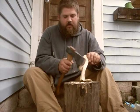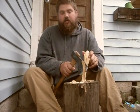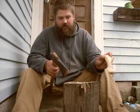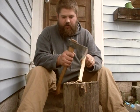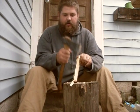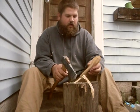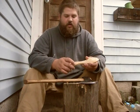Take the hips off on the back side just like you did on the front side. A safety tip: don't bring your axe way up here - you'll hit your hand if you're off or your hand is tired. After doing a bunch of spoons, your hand will end up getting tired. So don't bring your axe way up above what you're cutting - try and keep down low and off to the side of where your fingers are. My thumb's up here with about an inch in between, and I try and keep my axe out of the way of my thumb. With just that much, I went from a split to almost a roughed out spoon.